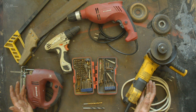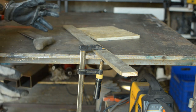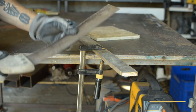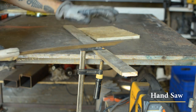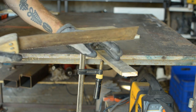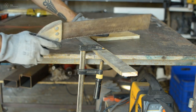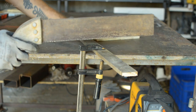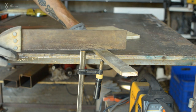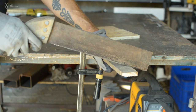When you want to cut wood, there are different tools you can use. With a simple hand saw, you use a clamp to hold the piece — always from the outside part of your bench. Don't try to cut it in an awkward position. If you don't have a clamp, have someone hold it far away from where you cut, and then just let the tool do its work.